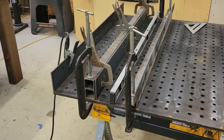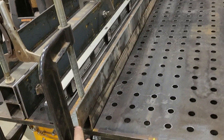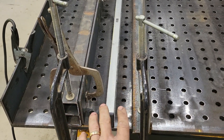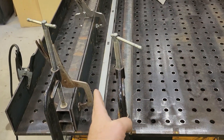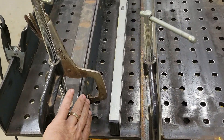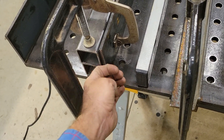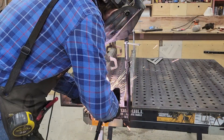I went ahead and decided to use two straightening setups here with the two-inch tubing. Unfortunately I only have one piece, so I'm going to use my angle iron — I think it's going to work just fine. I've created a flat patch in between the two setups. We'll weld this one up, then move it over and flatten that section, and just leapfrog our way across. This first piece is actually a half inch shorter than the ends, so it's 47 and a half inches, leaving enough room for the quarter-inch plate that goes along the ends. Just make sure you've got a quarter inch on each end and you should be good.